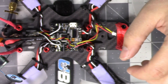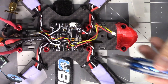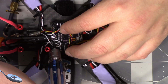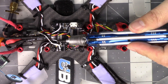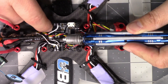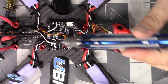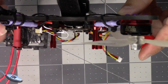I'm going to do a tutorial on how to set one of these Betaflight F3 boards up. You can see the video lines going in here to the video out. The audio line — the white line — is hooked up to the TX of one of the UARTs. In this case that is UART3. You just solder it into the TX line and plug it in the regular plug for TBS the way that it goes, and then you're ready to set it up in Betaflight.